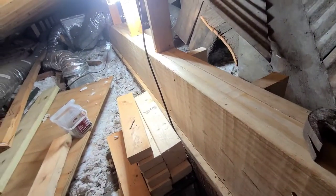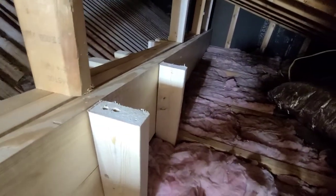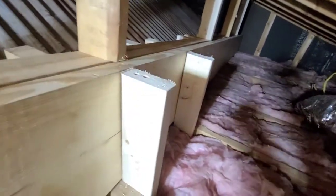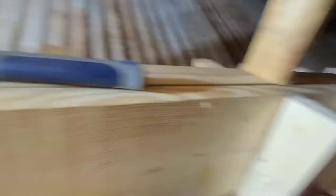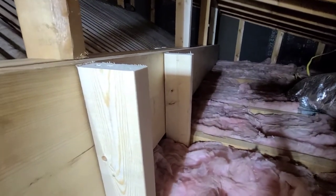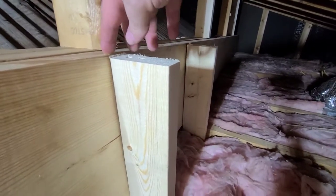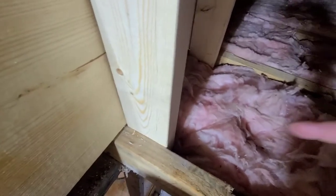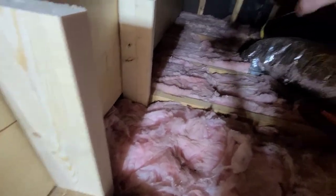I've got the third beam in on the left side. Now I'm going to work on getting it in on the right side. This one's going to be a little more intricate. I screwed into the face of each 2x4 on the back one. On this one it's a little harder because the face of this 2x12 we're going to be gluing to the other two. So I have to fasten them onto here from the outside, then pull this back off, lay it down, come in through the face of this 2x12 into these 2x4s like I did on the back side, then put glue on that, push it back up, and screw it back down to all of the ceiling joists.